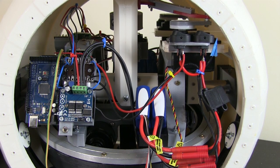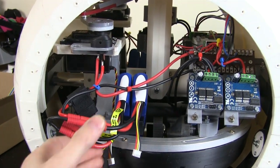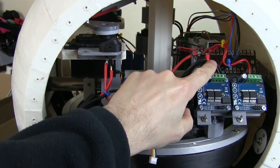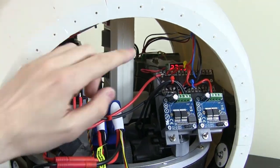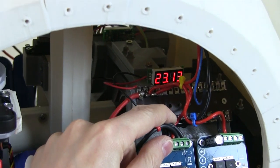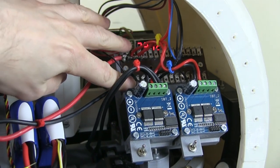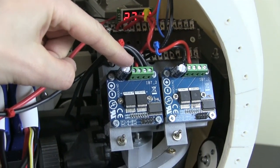I spent a little bit of time wiring some things in. Looking around this side, the motor wires are in series — they go out and in, and the connectors deal with the series connection. I've got a big blade fuse in there, and a power switch that takes power over to my power distribution strip. If I switch this one on, we should see a little display in there — that tells me the voltage. I've got 23.14 volts, so a tiny bit low, they'll need charging, but that is series on both of them.